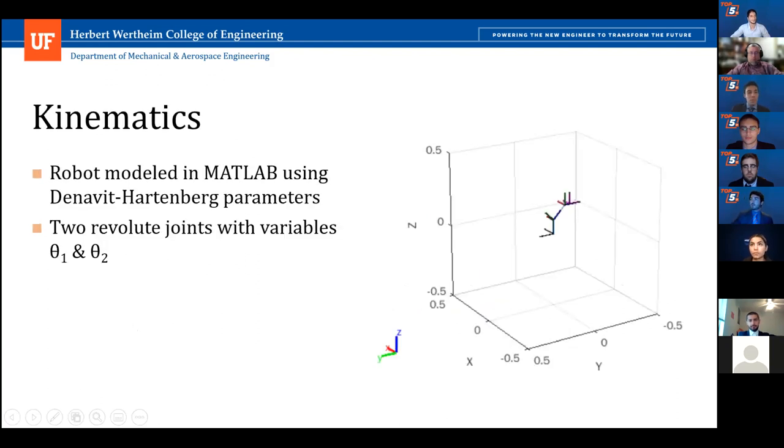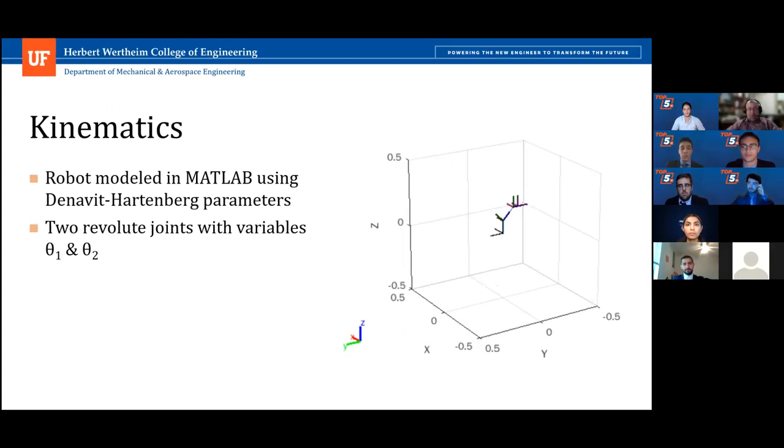To understand the dynamics of our heliostat, we modeled it as a robot arm in MATLAB. We derived the model with Denavit-Hartenberg parameters and used those to create a rigid body tree object that we could simulate all possible orientations for the heliostat mirror based on rotation angles theta1 and theta2 for our two elbow joints. The rigid body tree object was specifically used to get the coordinate transformations from the base of the robot to the end effector — the mirror. The figure shows the rigid body tree in the home configuration, where theta1 and theta2 equal zero, with the mirror completely vertical and facing due east.